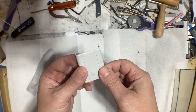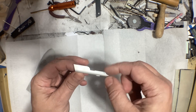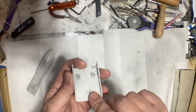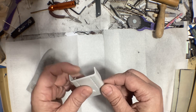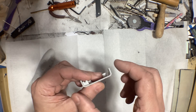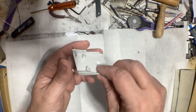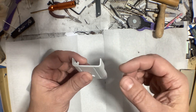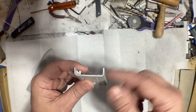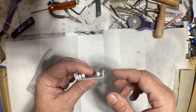The obvious choice would be to take a sheet of aluminum, bend the edges up, cut out the shape, and you're done — that was the first thing I was going to try. But then I started thinking: if you don't start the bends in the exact right place, the overall width would not be correct. There is math for planning that out — it has to do with the thickness of the material — and there are ways to do it.